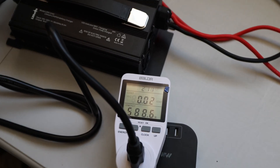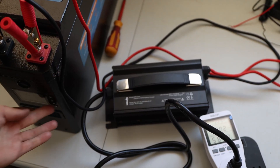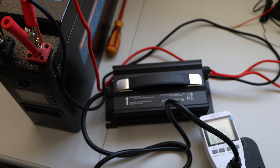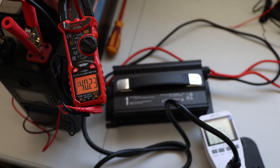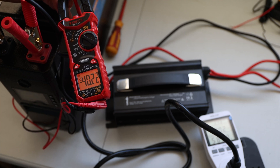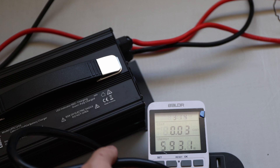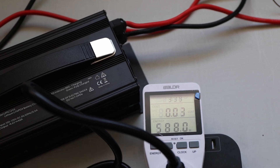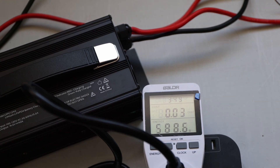We have it running for a little bit. Here we have the device itself, and you can see the battery over here charging. My display says it's charging with 39.34 amps. Since you never know how accurate that is, let's use this other meter — and here we see it is charging the battery with 40.26, 42.4 amps. We are pulling 592, 594 watts.